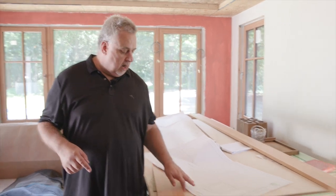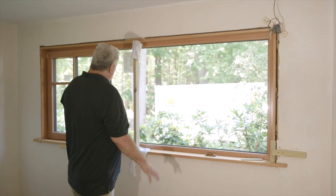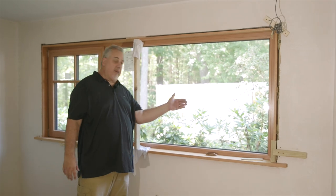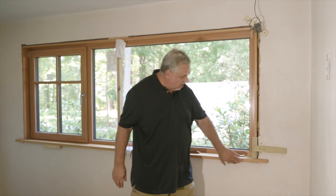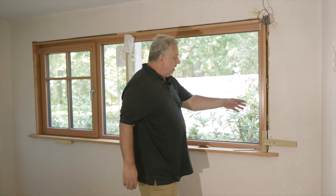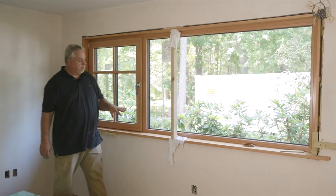Let's go look at one of these being installed. We're out here in one of the bedrooms. This is a whole-house remodel — we did some additions, some rooms just got remodeled. This is one that just got remodeled; there was an existing window opening here. We had Schüco make a window to fit that — this is a masonry opening from the outside. You can see the sill gets installed with the horns setting out, ready to receive the casing. We have that three-piece jam unit and head unit here that gets installed, all properly shimmed and installed, with the guys holding it in place.